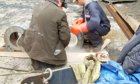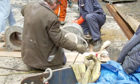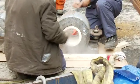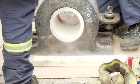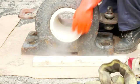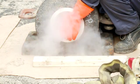After more time in the nitrogen, it slides easily into its carrier. By keeping the housings horizontal during insertion, the bearings are positioned accurately to provide axial space for expansion at both ends.